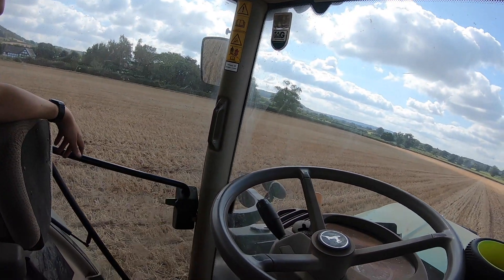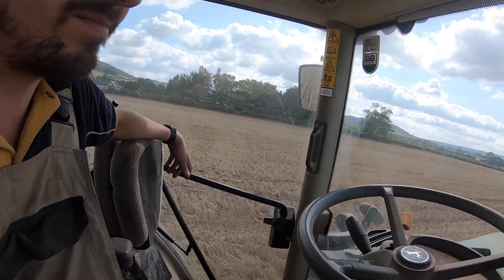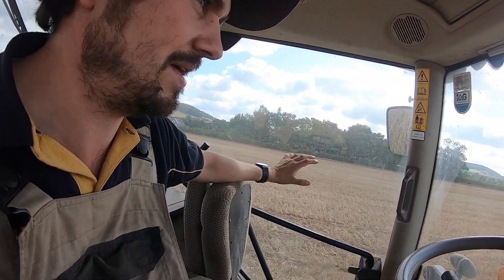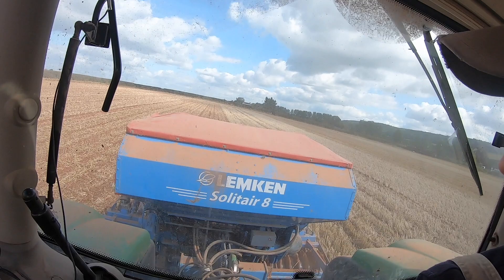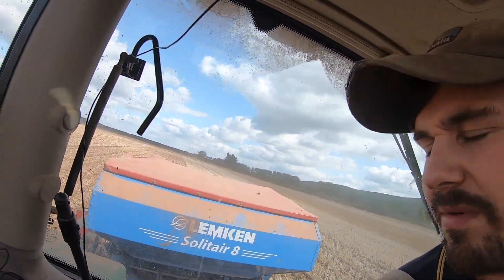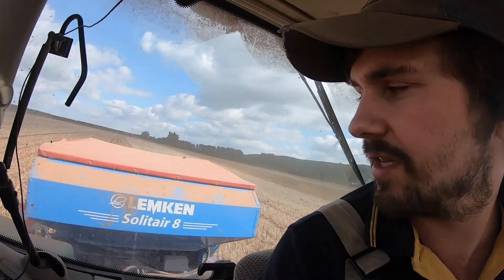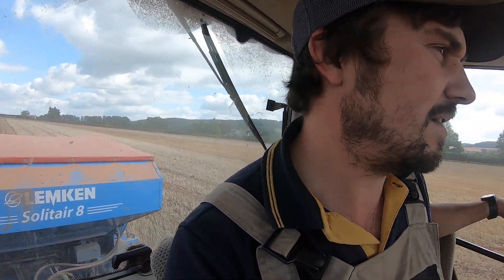That's the current plan. It's pretty hard going. I've been through with the flat lift — it's done quite a good job of actually breaking up the soil. It's definitely struggled to get in here going straight in without that, but it's done a nice job and hasn't disturbed the soil too much. So we've retained quite a lot of moisture, which you can see coming up. Got the power harrow working a bit — it's probably in five or six inches, just to do a good old mix with the straw and the trash. The seeds are just being placed in the soil with the press wheel, just pushing that down to get a nice bit of soil contact.